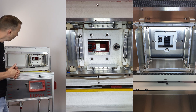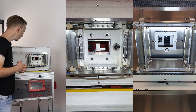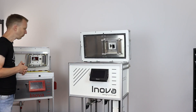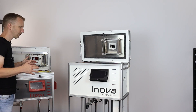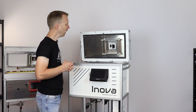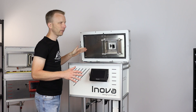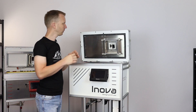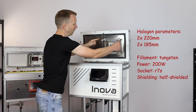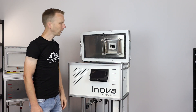These are the 118mm bulbs. But with a print bed of 175 by 175mm I had big problems with so-called cold corners, and I had to add four halogen bulbs into each corner. It was only at that point that the printer was able to actually print something — until then it was just failing layer by layer. That's why I was really happy to find companies which were able to customize every parameter of these quartz infrared bulbs for me: the length, the wattage, the sockets — everything. So here I am using two lengths of bulbs, shorter ones and longer ones, which I can cross without overheating them. The outline of these bulbs is now equal to the total area of the print bed.